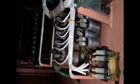Check the cable connection and resistance of the coil winding for droop transformer T4, and compare with a normal one. Check capacitor cables. Check all cables related to the diode, rectifier, thyristor, and others.